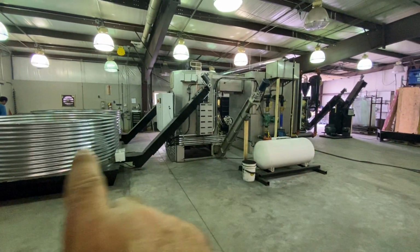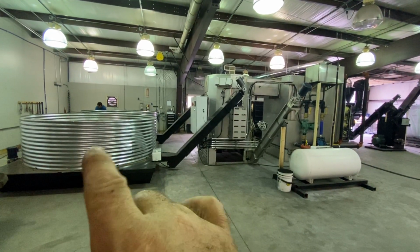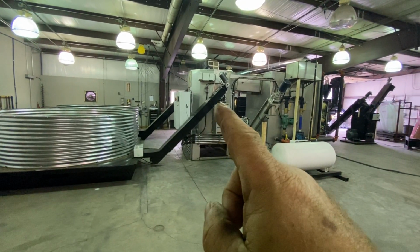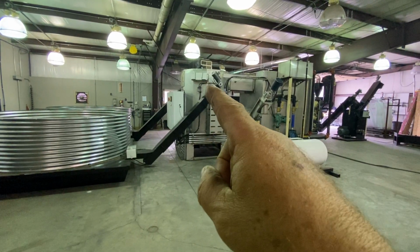This part of the system is the heating system. So we have fuel in here. I'll show you in a minute. It's a mixture of sawdust and coffee because we're drying coffee at the moment. This is the firebox itself. So the biomass comes up, drops into the firebox where it's heated.